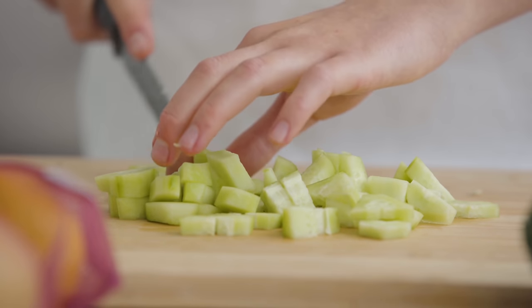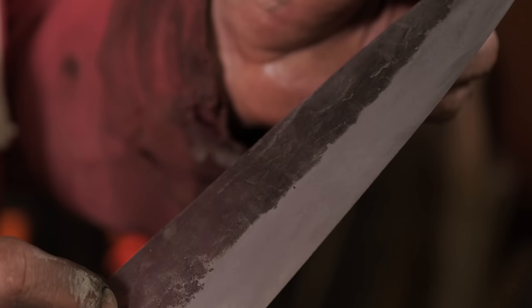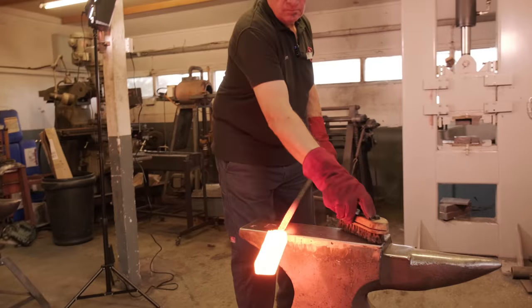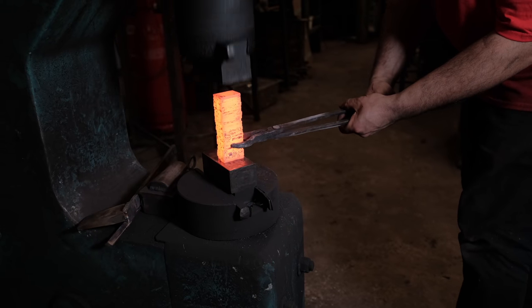To me, especially if you're using it for a kitchen or culinary knife, I really don't see any serious advantage in having a carbon steel knife - unless of course you want to make fancy patterns like Damascus. Your carbon steels are needed for that; stainless steel Damascus is very much more difficult to make, it can be done but it's easier with carbon steel. If you pick the right kind of carbon steel - for instance if I'm making Damascus for a kitchen knife, I don't use 1080, 1084, or 1095 for my core.